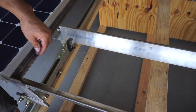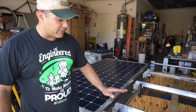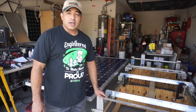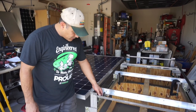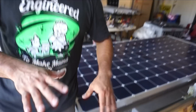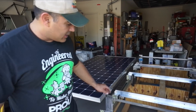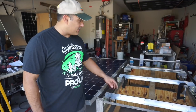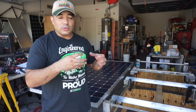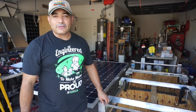With the bottom panel slid out, you can see the skeleton of the framework. It's pretty simple — almost like a bed for the solar panel to rest in. We're going to line the inside with thick rubber to pad it a bit and to prevent dissimilar metal oxidation, since this is steel and the panels are aluminum. We've welded every exposed seam we could without interfering with panel placement, so they're nice and strong. You can pretty much lift this entire assembly by the rails. When we put the panel in, we'll bolt it all along the panel with quite a few bolts.